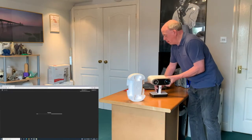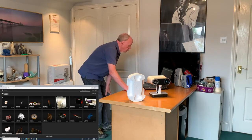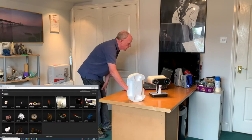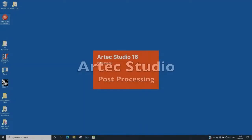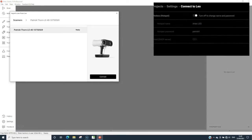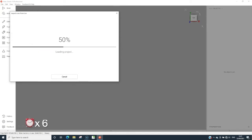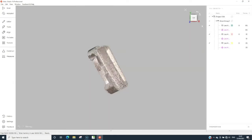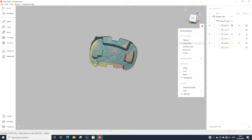So we get around to the computer. What we can see is the display being streamed from the scanner so you can see what's going on — you can actually operate the scanner from here as well. We've got the part on the screen. Here we're going into Artec Studio 16, connecting up the Leo via Wi-Fi. You've got the hotspot method or ethernet cable. All we need to do is choose the project and import what we just scanned. Once it's open, you've got the raw data displayed in the workspace. People using Leo or any Artec scanner will know this is the process.